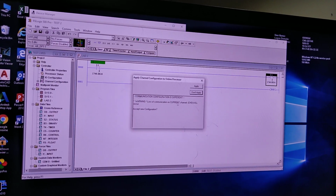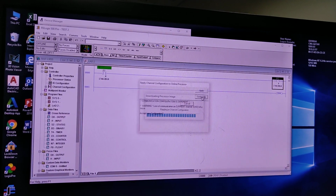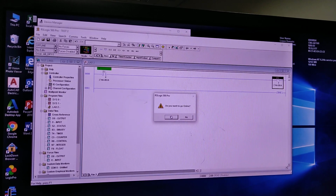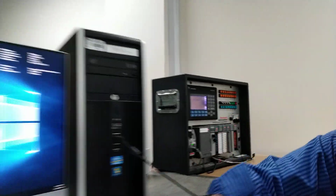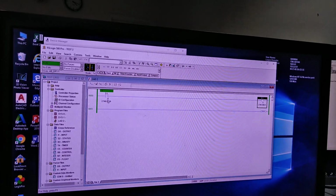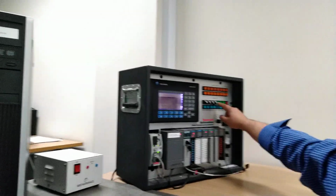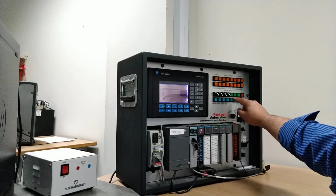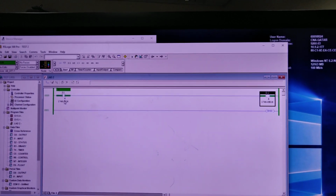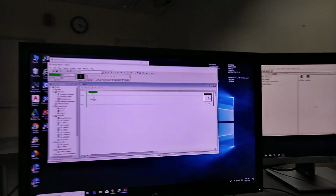There is a warning, lost communication, current channel. I'm gonna tell it don't apply because I don't care about this channel. Do you want to go online? Before I say yes, I'm gonna put it here to run, and I'm gonna say yes. So now I'm running online. Now I'm gonna click this button number 4. Button number 4 here, and then it's gonna light up my light number 4. And if you check in the program, when you click the button 4, it becomes green, active. Alright, that's what I'm gonna do on Sunday.